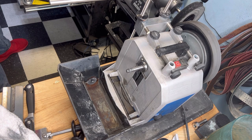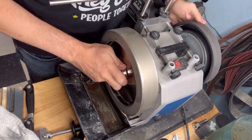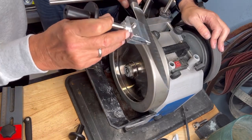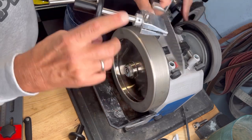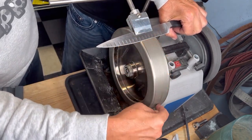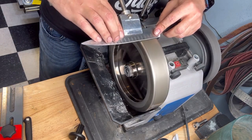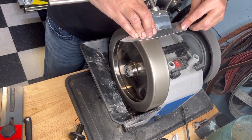Actually, you know what? I have a 1200. You are one of the last to get one, and I never had a problem with it. The problem is, if the coating somewhere is destroyed, maybe you go with this knife on it, lose control and come with this edge on it, and there's a little hole that destroys the coating. The water will go in there. You grind and press the water under the coating, and you get bubbles all the way down. Where the bubbles are, the coating is damaged and it breaks up and leaves the wheel. So for me, 1000 is enough, because the difference between 1200 and 1000 is not that big.